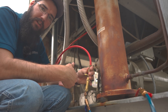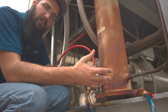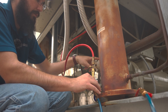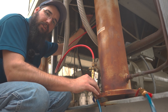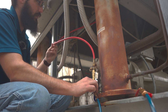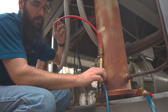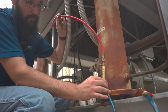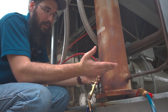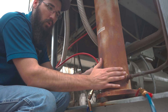We then had the building swap over to the chillers and let this unit shut down. The manual states that after about 30 minutes of runtime, you shut it down, give it about five minutes, and then check the actual level. We disconnected from the discharge port and moved up to the liquid line port for a higher elevation reading, which allows the sight glass to work a lot more smoothly. One thing to be careful of is dips in the hose that can create an airlock, so keep the hose elevated above the sight glass. Doing this, we found that the actual oil level is only about three inches up into the separator — it's supposed to be five to ten inches from the base — so we confirmed a low oil level situation.